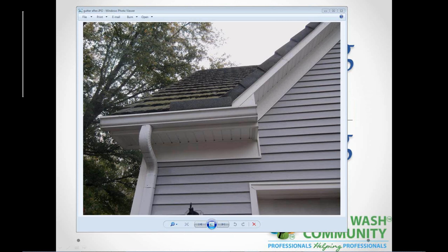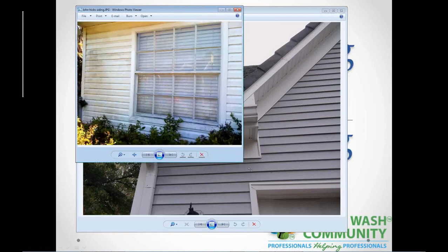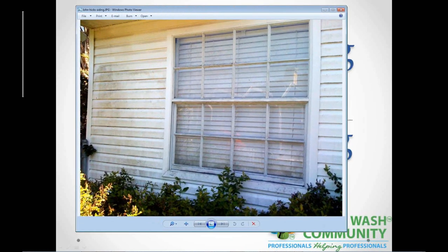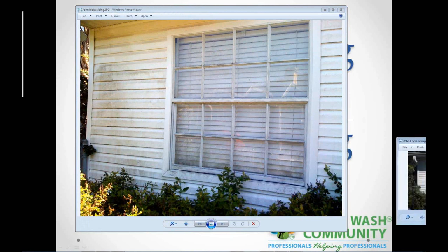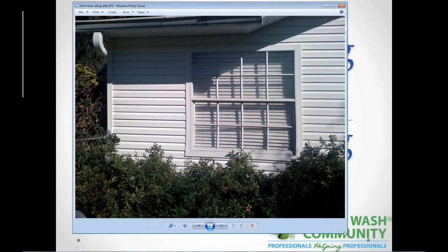And I think on the earlier dwelling with the stucco, we had a question if you used high pressure on that. No. It's all low pressure. This is my personal opinion. I wouldn't use anything over maybe 200 to 300 PSI. That's where I try to shoot at when I consider low pressure wash. Anything under 300 PSI is low pressure to me. Okay. I just shared those pictures up there for reference. We really don't need to get into those.